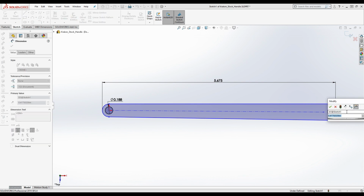So I'm going to touch this off with calipers. Now, how you hold the calipers can matter on this. You want to try to have the best contact area possible, but in this case you're also dealing with a lot of burrs, right? No matter where I'm putting it, I'm tending to get about 0.5295, 0.5285, 0.529, 0.530, right? So you want to measure it a few different times and wiggle the calipers around while applying even but not excessive force on the caliper wheel. And so what that tells us is that this is 0.530, right?